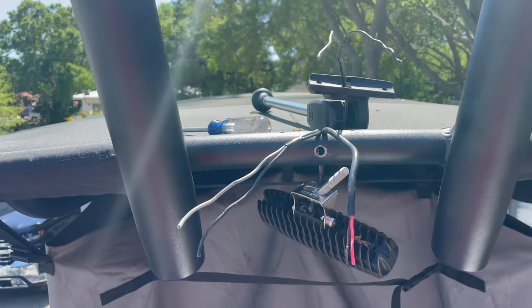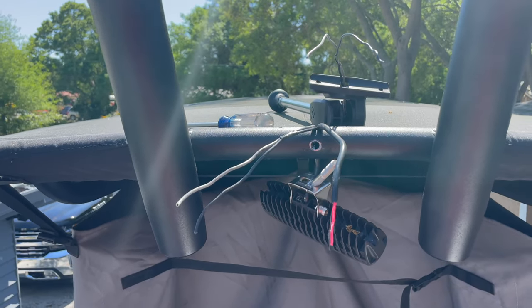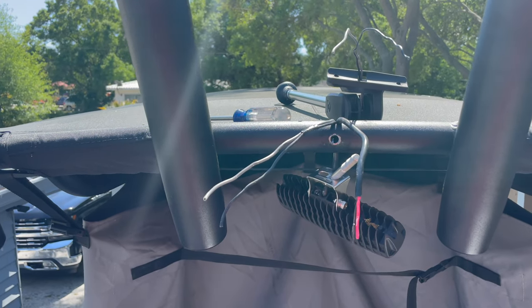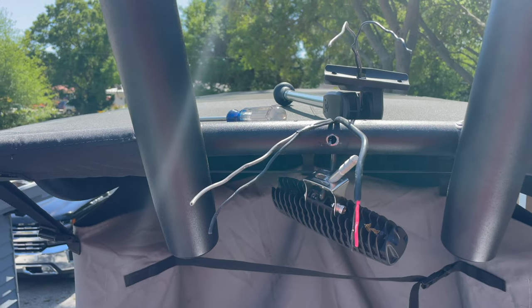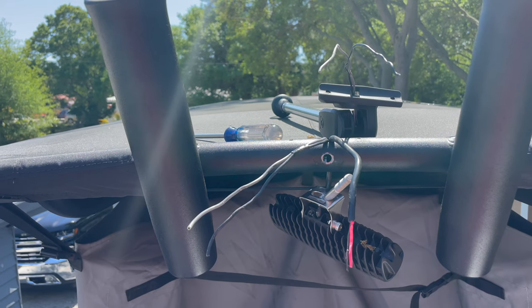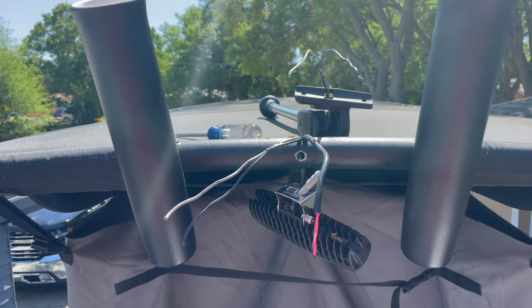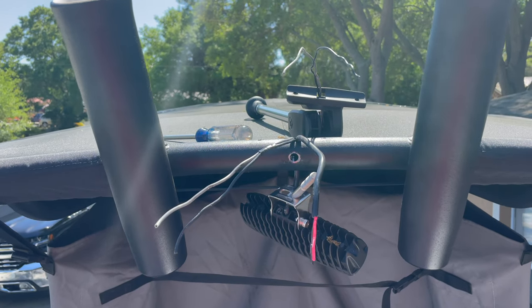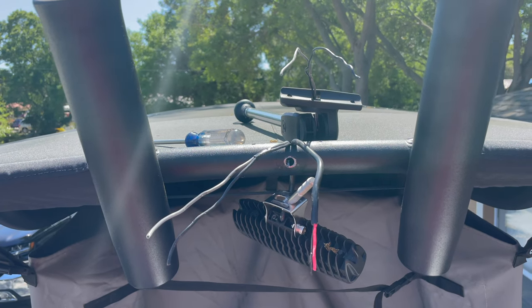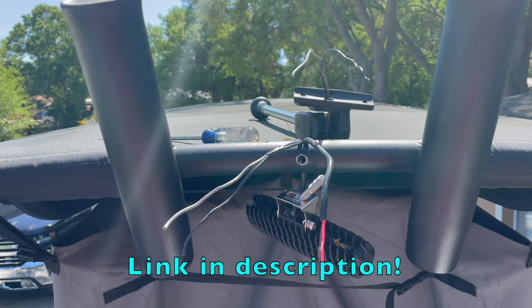What I'm going to do now is strip these wires and add a switch for the power side. When I turn on the navigation lights at night, it will supply power up there, but the switch will interrupt the power to the spreader light. This allows you to mount a spreader light without having to run a complete new power and ground all the way down through your tubing, and it lets you illuminate that spreader light when you want by the click of a switch — link will be in the description below.